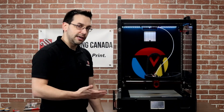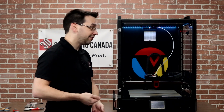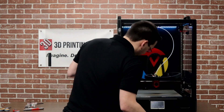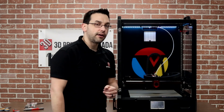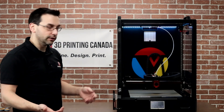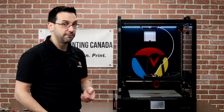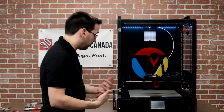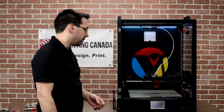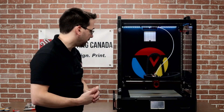On the back of the machine there is a USB-B port. I'm not sure why I'd use it since it's WiFi connected and I can send print jobs remotely, but it's there for diagnostics if needed. The machine is quiet, as expected. The hot end fan is temperature controlled — probably spinning up around 50 to 70 degrees and shutting down below that threshold. For cooling fans there are small 40x10 fans with shrouds on either side. I'd personally prefer a 40x20 or 50x15 blower fan — the 40x10s don't move as much air and tend to fail prematurely — but they fit the hot end assembly nicely.